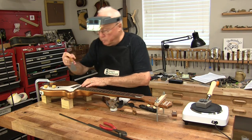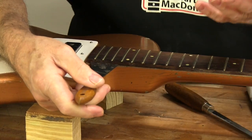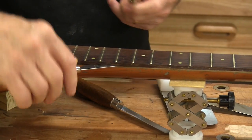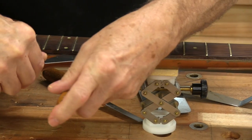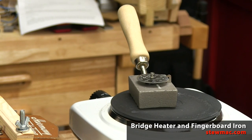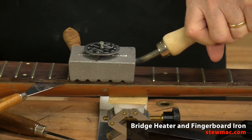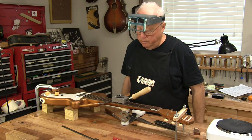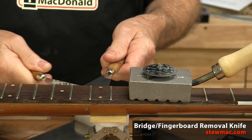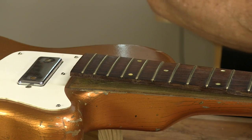I'm going to start at the easiest part right up here. It's like a completely dry joint. I like to work one knife on top of the other, always feeling like I'm over the wood. I can hear it separating, but I am going to use a little heat. My block of aluminum is heated up to about 250 on the top surface — probably hotter on the bottom. That's enough, from my experience, to get this board a little bit warmer and help break that old dry hide glue. In real life this is probably taking us 45 minutes — I thought this was going to pop off in 20 seconds. Each time I get another half an inch or an inch.